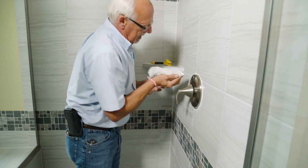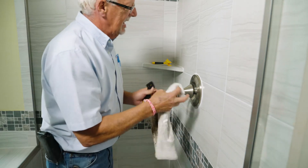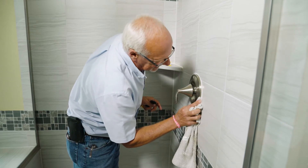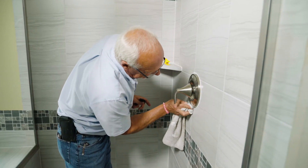If you have over-applied the caulk, you will have to try to remove the overage by using your finger and the sponge to wipe it off. If it still does not look right, you may want to completely wipe the caulk out of the joint and try again.